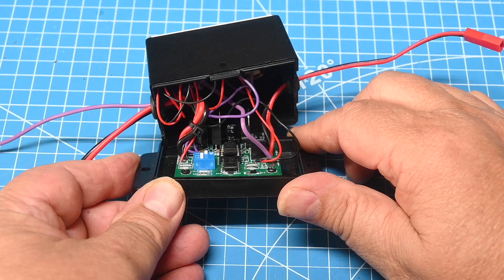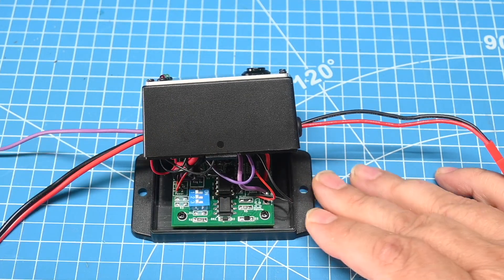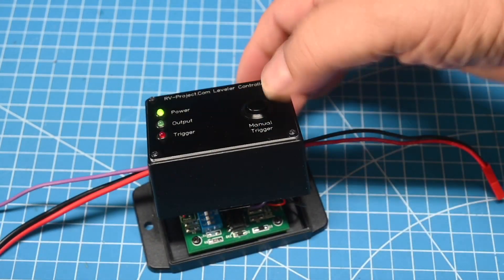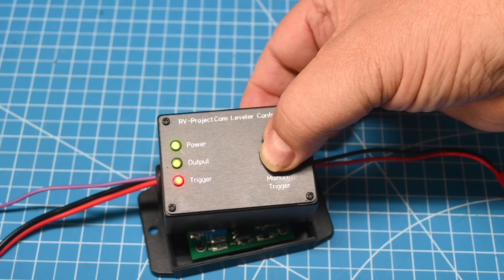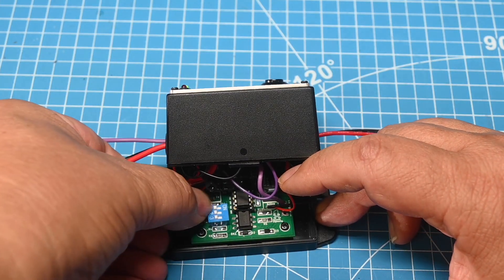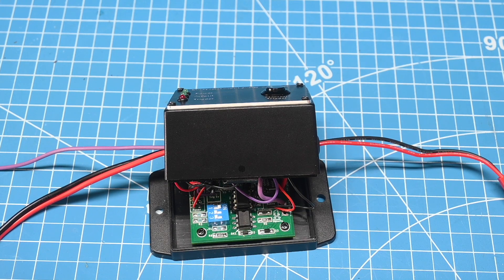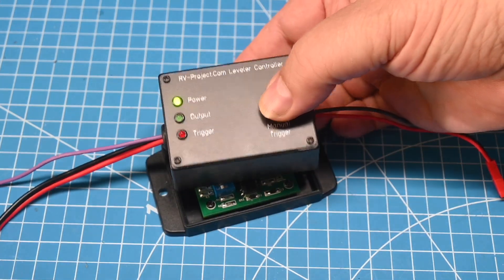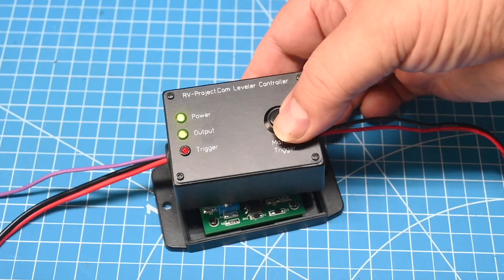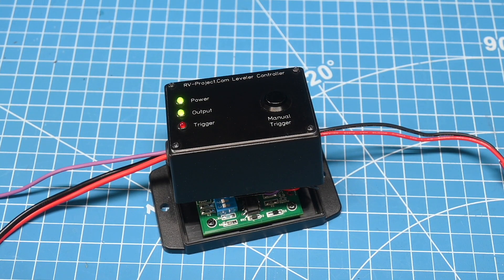Now that I have everything soldered together, I'm currently in mode 2, but I'm going to flip back to mode 1 just for a demo. You can see we have power. Mode 1 says the output will follow the trigger — trigger on, output on; let go of the trigger, output goes off. That's fine for a test, but I want to use mode 2. The issue with changing modes is you have to power-cycle the device — turn it off and back on — because I designed it to only read the mode switches on initial power-on. Mode 2 says that upon a trigger, the output will stay on regardless of the trigger's behavior, and then turn off 15 minutes after the last trigger. I'd say this is working.